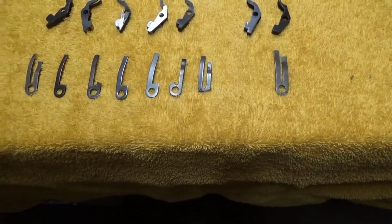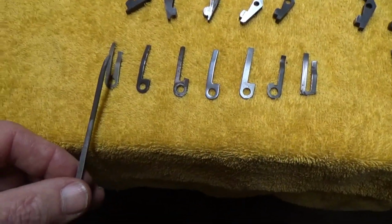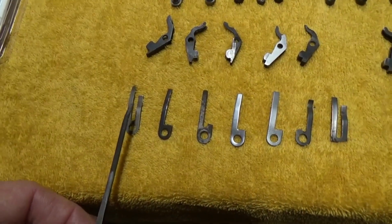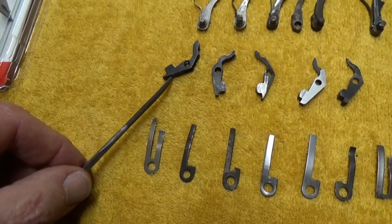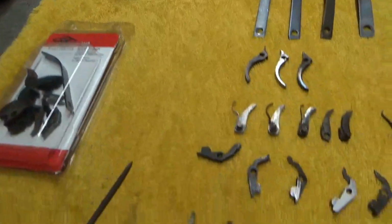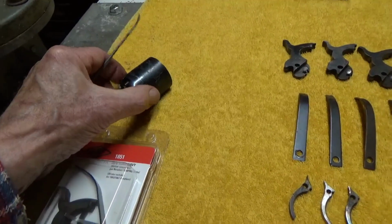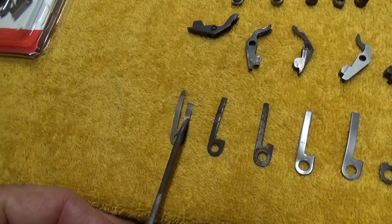Troubleshooting these is a little easier than some of the other things, because if you cock your gun and the cylinder here does not lock up, just continues to spin kind of freely, that means that the bolt section over here of the spring is not applying pressure up on the bolt. It's not locking into the notches over here. So if you can cock your gun, it comes into the full cock position, and your cylinder still rotates like this, there's a good chance that the bolt spring on this side is broken off.